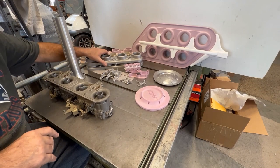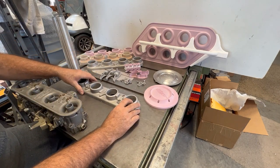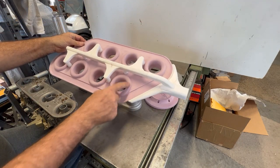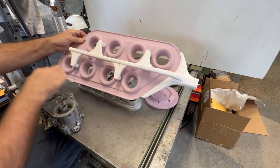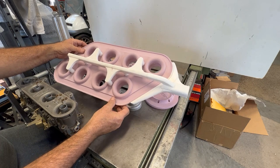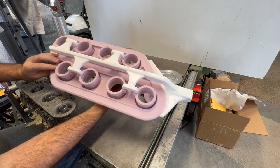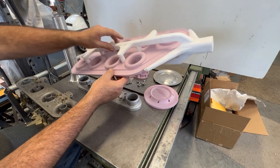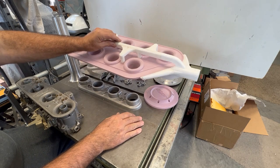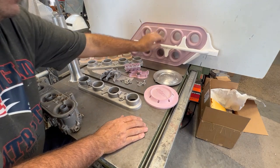Those guys really liked them. This was kind of a setup part for the casting, and here's one of the actual castings ready for machining. For other customers I have — in fact for the intake manifold project — if you ran a pair of these, this is a bell mouth filter base. I haven't cast it yet, but it interfaces with the air filters from that induction system four-part series. It has a bell mouth transition just like a velocity stack, but you can run air filters around the perimeter. On the bottom it's got the same pinch clamps that bolt onto straight sections of stack cut to any height.